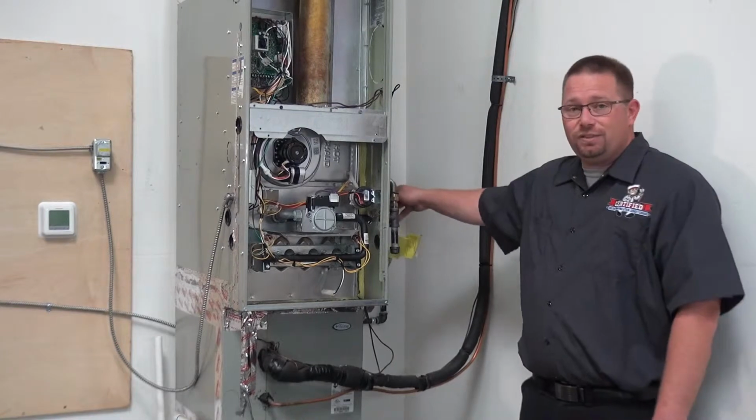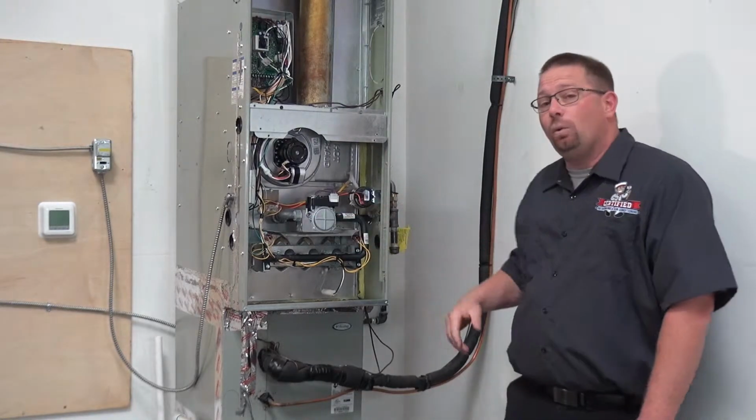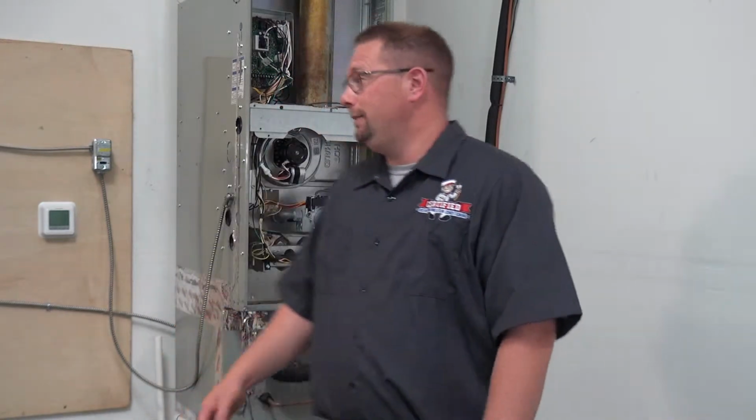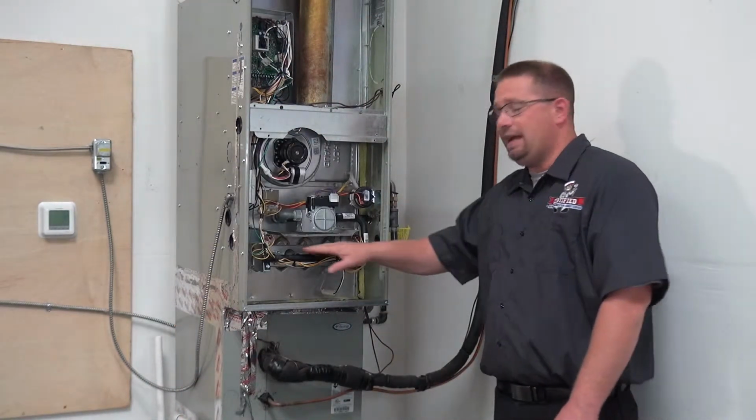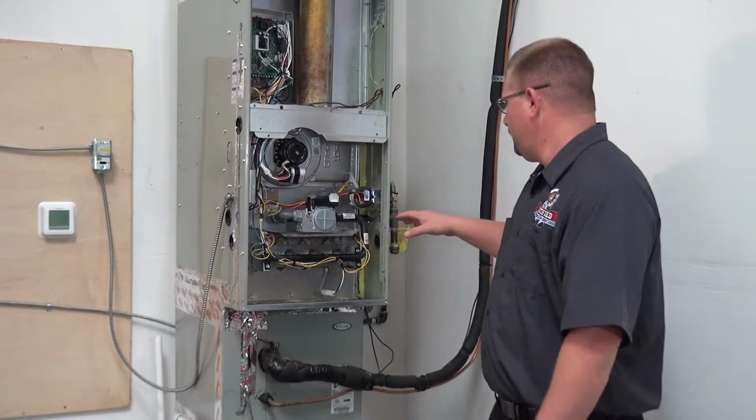We have a gas flex that's flexible, and then we have a hard pipe that comes inside here. Now, if you were working around the equipment, or maybe a box bumped it, or somebody tried to wiggle in there and get something going on, you could have knocked a fitting loose. We don't want gas leaking. If you got gas leaking out right here, and then we have fire right here, that could cause a boom that you just don't want in your house.